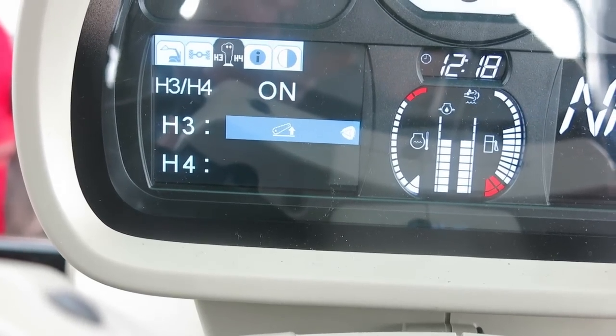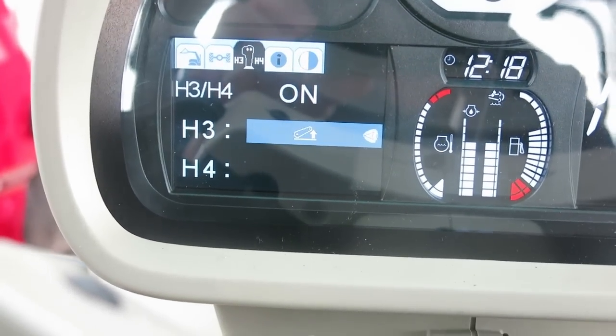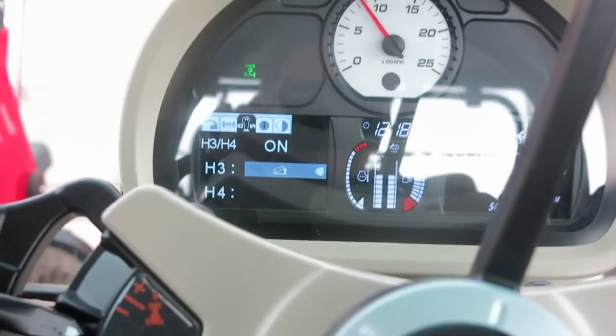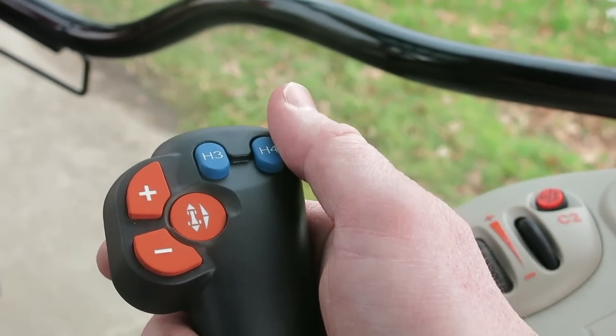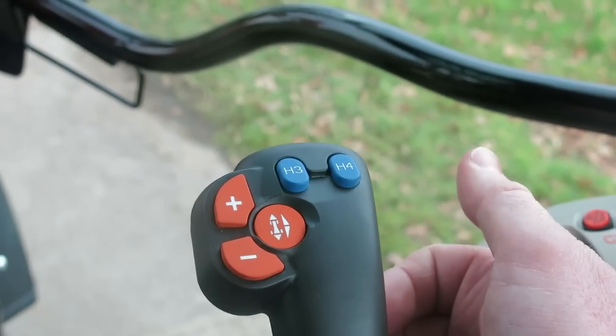Or you could have it for a turnover on the ram — turning over your plow. There are electrical and mechanical spools. On the joystick you can set up your timer on your hydraulics — set it up for six seconds or whatever — and then drop your linkage on your H3. So technically you could turn over the plow by pushing this lever to the side, but you can just set it up on a pump for six or seven seconds and it'll turn the plow for you automatically.